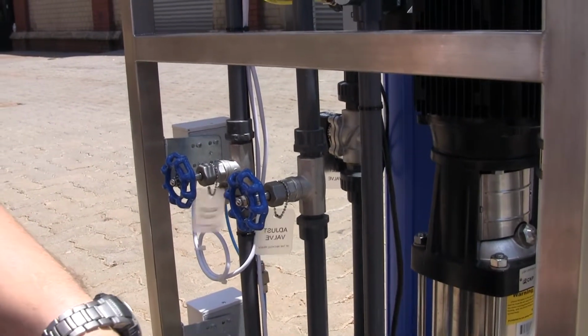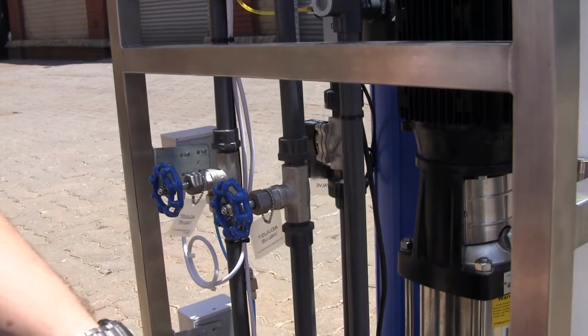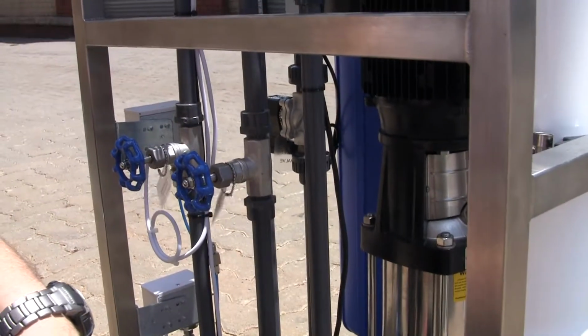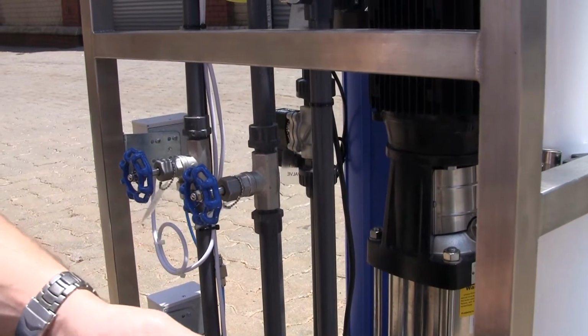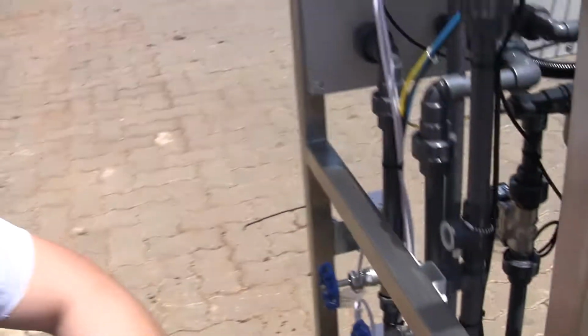What's very important is empty it, flush it very thoroughly with clean water again. Okay, if it's with just the low mineral content flush, then it's not important, but if it's anti-scalant or biocide, you really don't want to drink that. So before you connect it up to run to your normal water supply, make sure you've flushed it thoroughly.